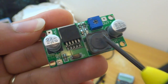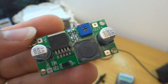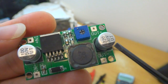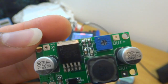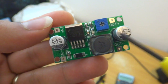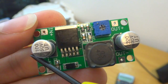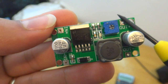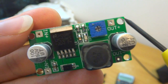This was the biggest inductor I could get, since these boards usually come with 33 microhenry. The recommended output capacitor is actually 180 microfarad, and 220 is fine. I'm not going to modify it, but if you want to use it for other things — for example, if your input voltage is 10 and your output is 5, because this is a buck converter, you need an inductance of 22 microhenry according to the datasheet.